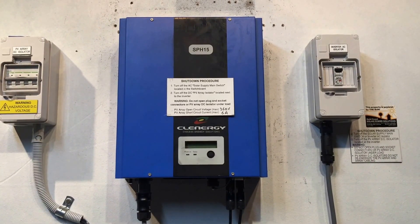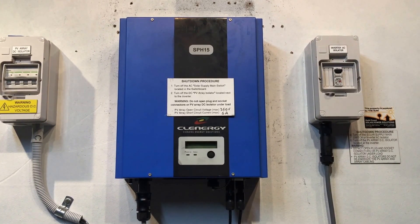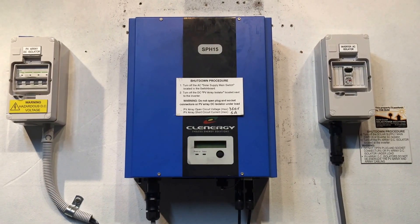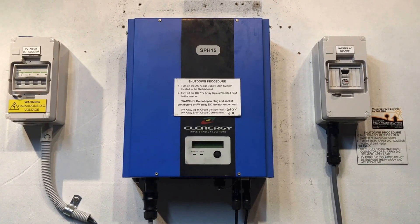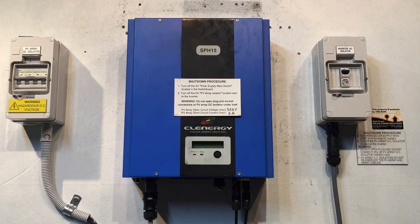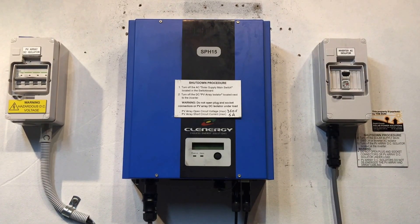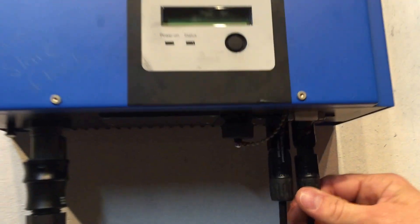It's to keep the system as energy efficient as possible. So if it thinks there's no power coming down from the solar panels, there are a couple of things you want to check first — and that's that the solar power system is actually connected. You want to make sure the DC plugs connecting the solar panels are plugged in.